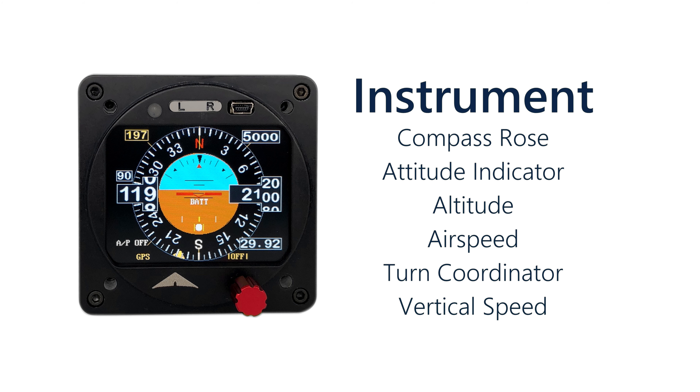Once you activate the autopilot, you will see two green triangles, one on the left and one on the right. The one on the left indicates that you're flying a heading or track. The one on the right indicates that you're following an altitude — in this case, a vertical speed, because you see the green triangle on the vertical speed. If you choose indicated airspeed, you will see the green triangle just above the selected airspeed. When the autopilot is following an external GPS, you will see the waypoint on the bottom left-hand corner of the screen and the CDI needle will turn on following that waypoint.